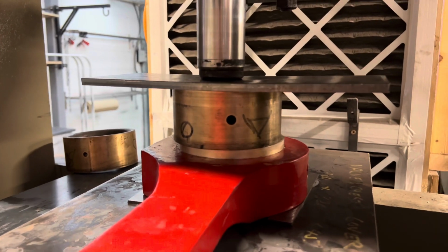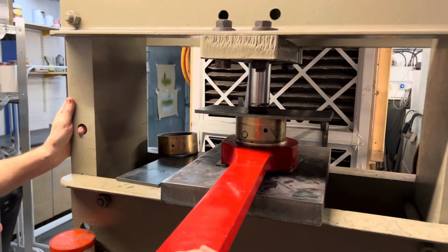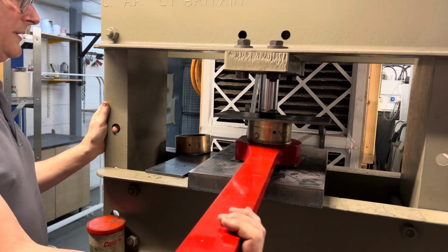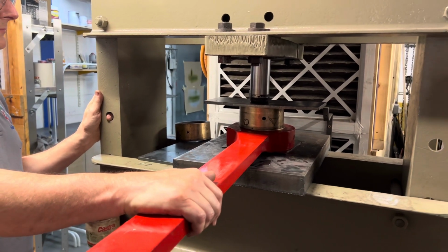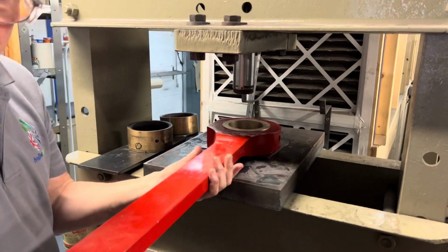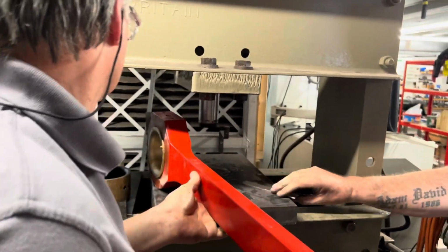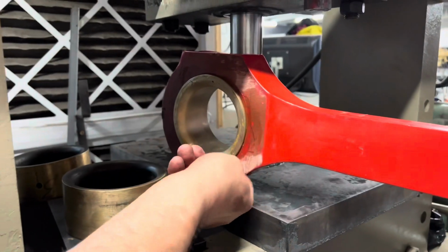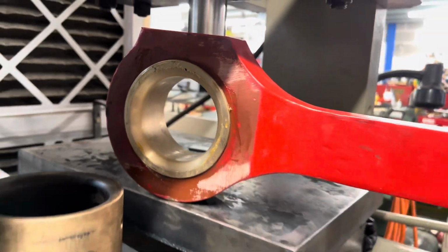Now, interestingly enough, the internal bore where the crank pin goes through has to have, according to the Locomotive Manufacturers Association handbook, between 12 and 15 thou clearance on the crank pin and the internal bore. Now, of course, we could machine it to that, but as soon as you then press it in with a 5 thou tolerance on the outside, that shrinks that down. So what we actually had to do was we bored the internal bore of the bush to allow an 18 thousandth of an inch oversize hole, so that by the time it's been squashed into the end of the rod like that, you've pressed that 18 thou down to about 12 to 15 thou. So that's how we've achieved that accuracy at that point.